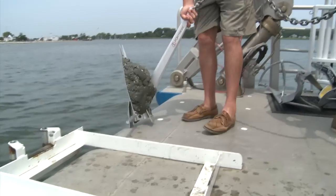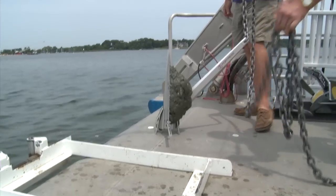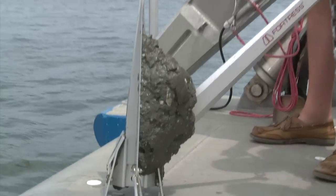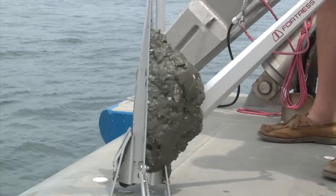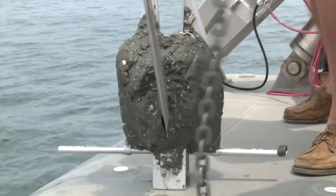When the anchor came out, it had a completely different kind of mud on it — a very dry, crumbly mud that wouldn't stick together like the gelatinous material before, with a lot of sand, gravel, and shells. We estimate the anchor was at least 15 feet and perhaps as many as 20 feet down into the mud. When we got directly overhead and pulled up the cable and chain, we still had about 20 feet of cable straight down — buried deeper than any anchor to date. When retrieved, the anchor was in perfect condition, and we were going to give it another test.